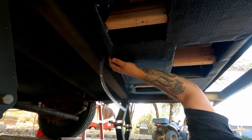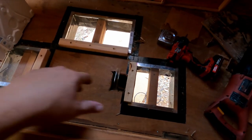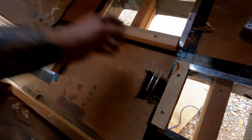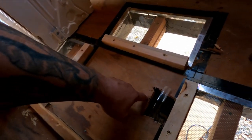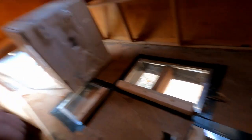I was just drilling the hole for the drain vent right here and sticking the hose up. Before I finished making all the little wings for the ducting, I almost forgot I had to do the drain. I got the little drain spout thing here on the air conditioner, and I went ahead and cut this hole so I can run the tubing from underneath. This is going to attach over here. Normally you could just drill a hole straight down, but since I'm going to have this door system under there that hinges and moves, I needed to bring it back - cut the hole here and run the hose up through.